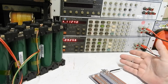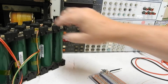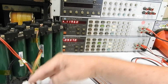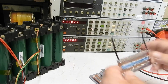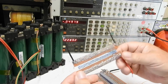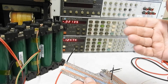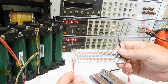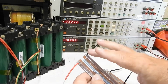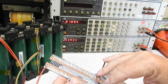And the obvious answer to fixing that is to just use a much higher test current, which is what I did with this 16.5 volt battery. And I made up a 20 ohm resistor for the purpose, and this both limits the current from the battery to not hundreds of amps, but to only less than 1 amp, about 800 milliamps. And it also gives me something to measure the voltage across, so I know what the current is.